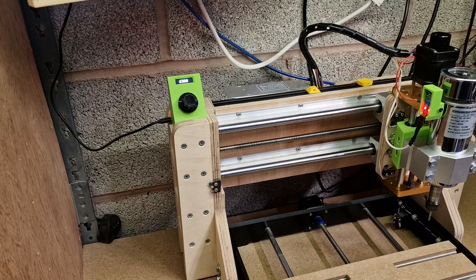We measure it over one second and then multiply by 60 to convert into RPM. There are more complicated ways of doing it, but this is quite simple. Everything is in base 60, and 60 is the lowest resolution it can go to, but when we're talking about 10,000 RPM we're way more than accurate enough for what we need. It's only an indicator of where we're up to.